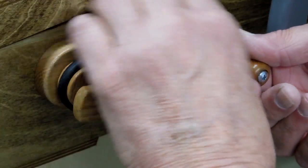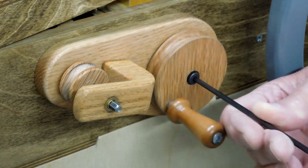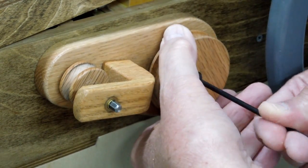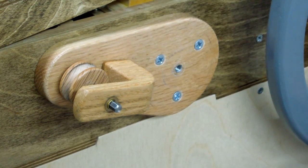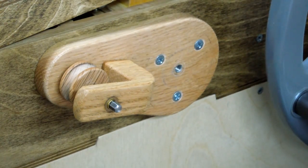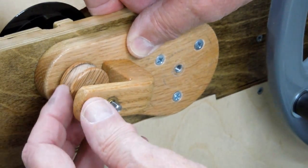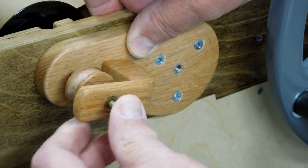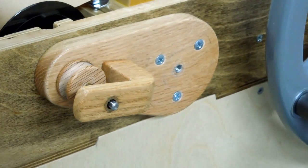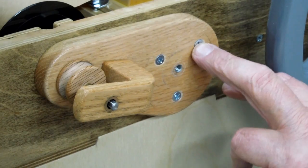What I've done — I've changed this on mine. I found some shoulder bolts so I re-drilled this for a shoulder bolt. When I was drilling this, I put a clamp on here and made sure that this was engaging on one of these plastic spools, and I drilled and countersunk this first wood screw.